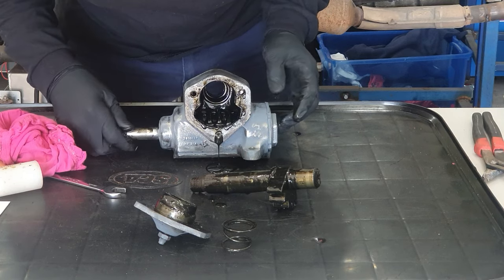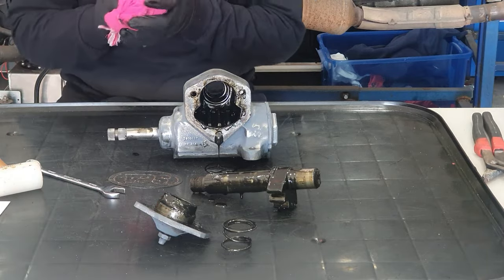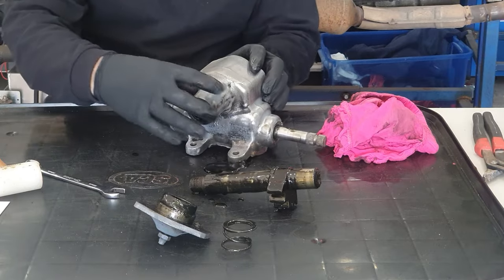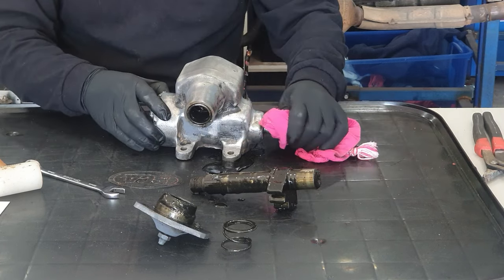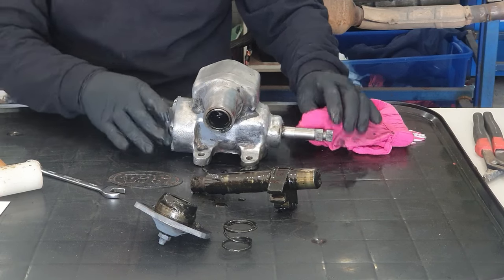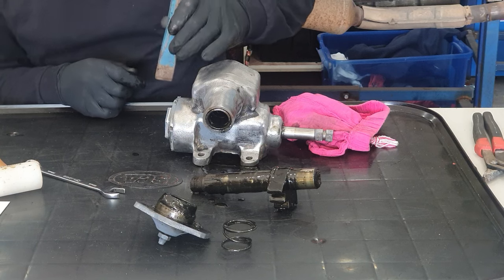This should not have this much oil and crap inside it. Like I mentioned before, this is a ball screw. In this back part here it's got needle roller bearings. I'll be pulling them out, cleaning them, re-lubricating them and putting them back in. Everything worked fine on this steering box mechanically - it just leaked oil. So I figured I'd give it a service while I've got it apart.